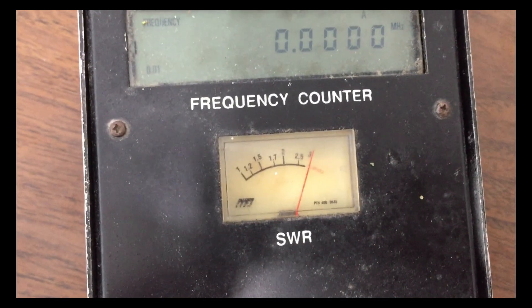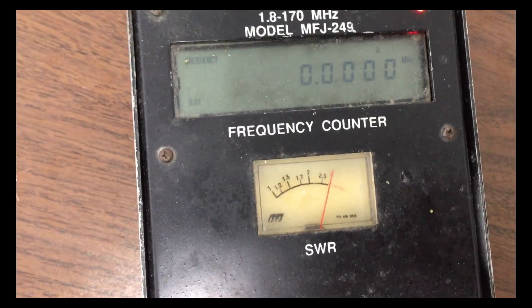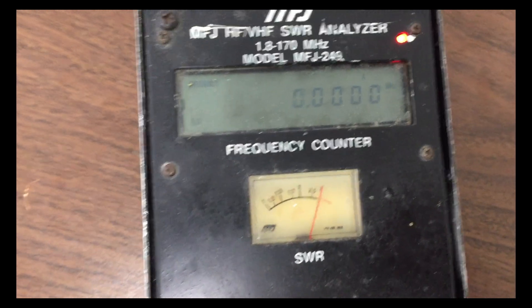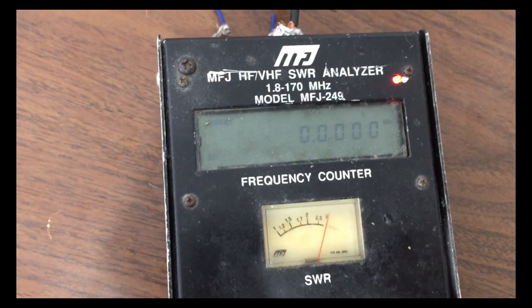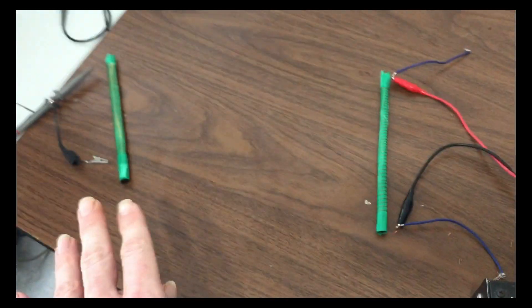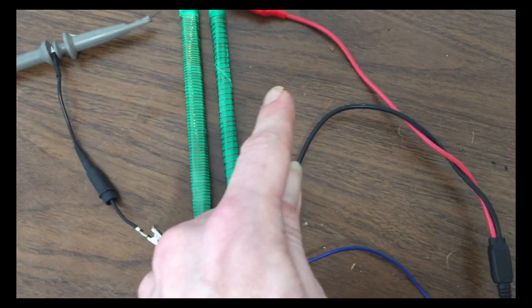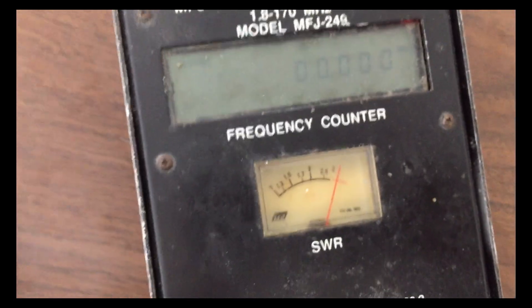What would happen is if I put a secondary nearby — if this SWR meter moves more to the red, it means it's feeling a reflection back, an opposing field interfering with it. If the meter starts going down back toward one, it means we're absorbing some of that load, acting like more of a transformer action, which we don't want. So right now the antenna is far away, not coupled. But see what happens when I get right next to it — look what happens to our meter. It goes way up in the red because we're very close, detecting that reflective wave back, showing much less efficiency because our input is working much harder.